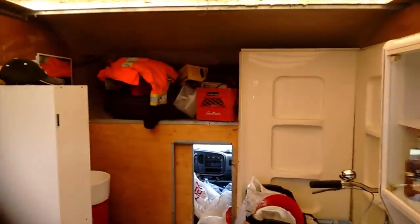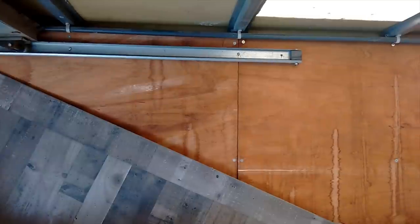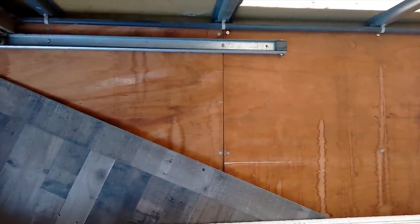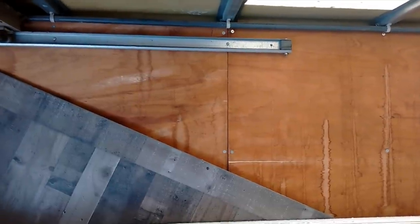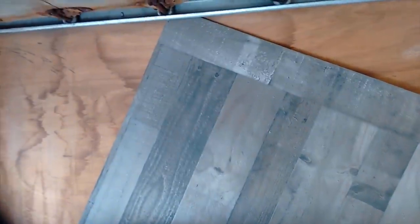Let me turn you around and show you what we're doing today. Today's job is going to be this wall — insulating — because I'm going to be up north a lot in the cold. It was freezing cold on the way down here to Florida, so hopefully on the way back it won't be so cold. This is the paneling that will ultimately be on the wall, and I'm going to spray foam a little on the inside, put this one-inch foam board on, and then the paneling on top of that.